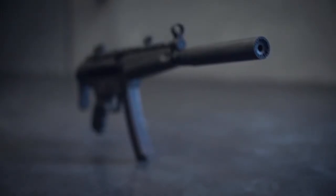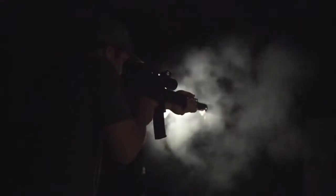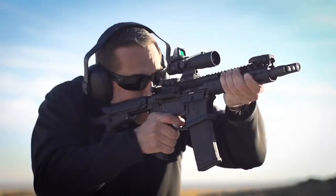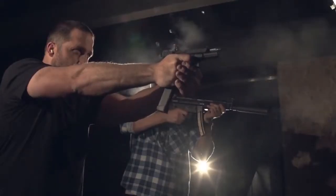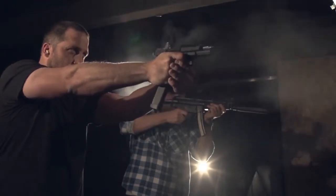Firearm suppressors are devices used to reduce the sound of firearm discharges, and work by trapping the rapidly expanding gases exiting the muzzle of a firearm in a series of chambers that allow the gas to expand and cool before exiting the firearm. Without a suppressor, these gases rapidly expand from the muzzle once the bullet exits the barrel, producing a sound that can be anywhere from 140 to 190 decibels in magnitude depending on the firearm.